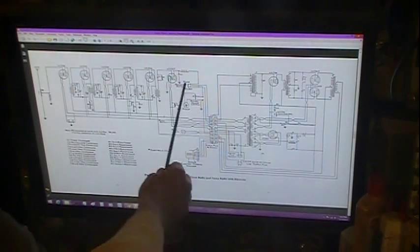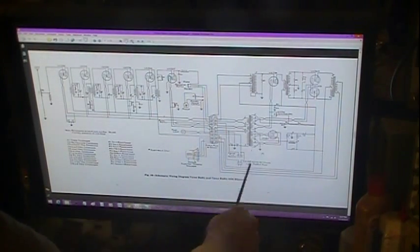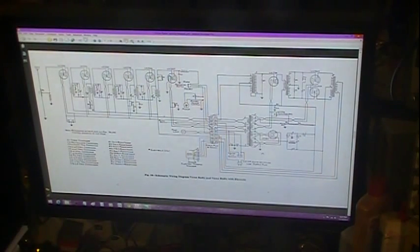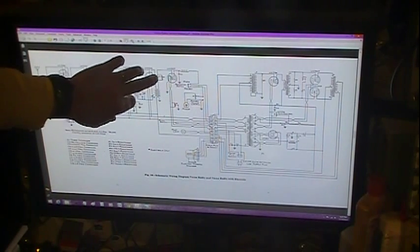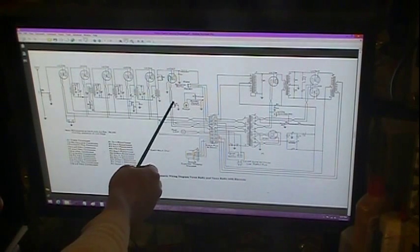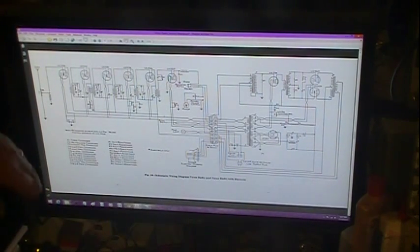The other thing is, why the two different 2.5s? Well, these are self-biased with 775 ohms for a push-pull output. This guy is grid leak. That's what C3 and R9 is. It's grid leak biasing. It's the detector. It has a hum control. There's the other hum control that's controlling just some hum that picks up off this AC coming in there. Even though it's an indirectly heated cathode, there can still be some hum there.